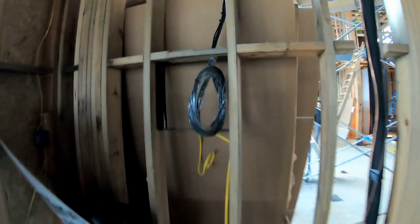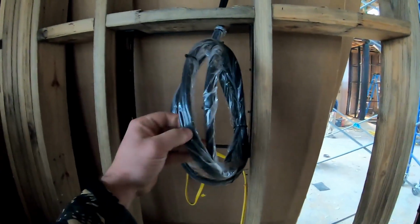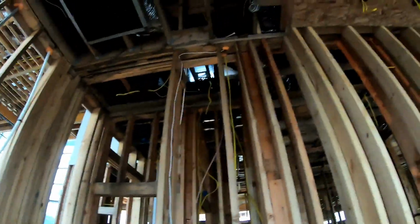We're not going to be able to see it from the other side. This is our family room TV right here. We got another recessed back box, so we can do our razor thin line moves to keep the TV as snug as possible. All of our runs are completely poly wrapped. We typically run 2 Cat 6 and an RG6. Sometimes we run 3 Cat 6 and RG6 depending if we need audio return or not. We have our security wires for our security keypad running up and through.